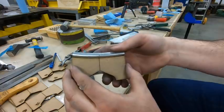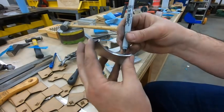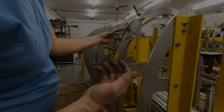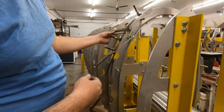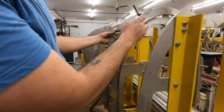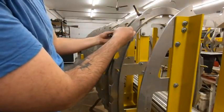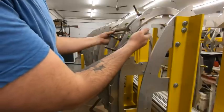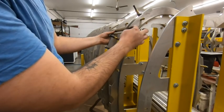It's very close to the contour, a little bit of extra shrink in there, which is good because I still need to trim this one here. One thing that people don't understand about the Typhoon's construction is that the stringers don't actually connect to the frames — they're only connected to the skin. With the exception of frame K and the backside of frame A, they're not attached to any of the ribs or frames in between. So what I'm looking for is that when it's riveted to the skin, it can move side to side and has a little bit of clearance up and down, because I don't want this new splice plate to be putting pressure on the stringer.